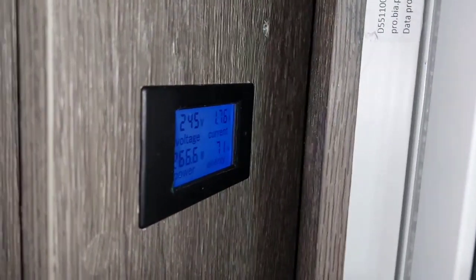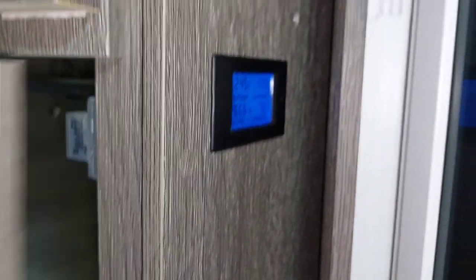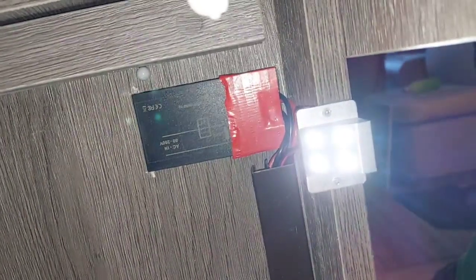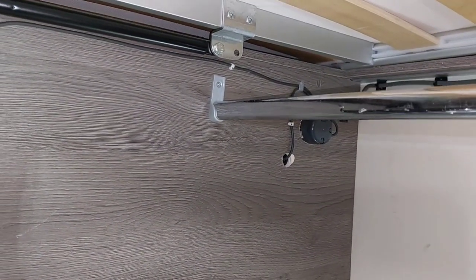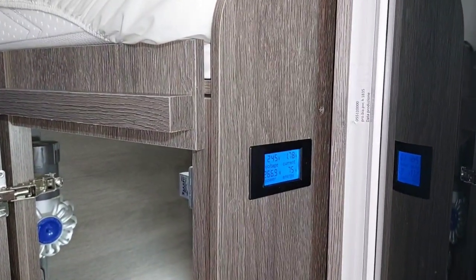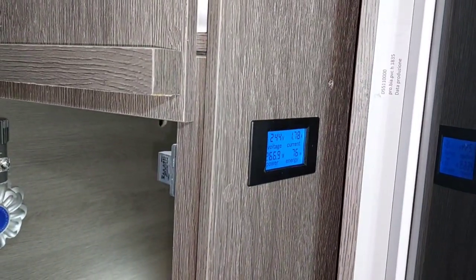In the top right corner it's showing 1.76 amps — that's what I'm interested in. I can keep using power up to about 12 amps. It's quite a nice little install, tucked up there in the corner. There's no cover on the 240 volt terminals so I've put a bit of red gaffer tape over them just as a warning — they're insulated now anyway. While I was there I've also mounted the Dyson in that corner and fed the cable through to the socket in the garage that the previous owner installed. Really pleased — it looks stock, like it was designed to be there, and it gives me a clear indication of how much spare current I have left.